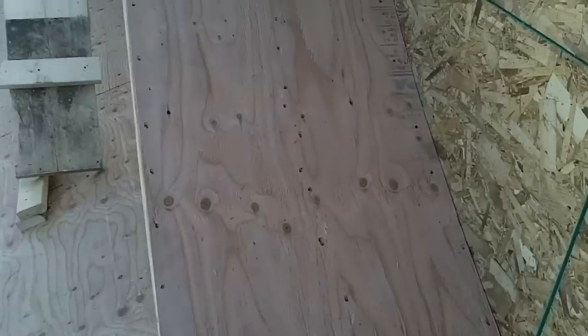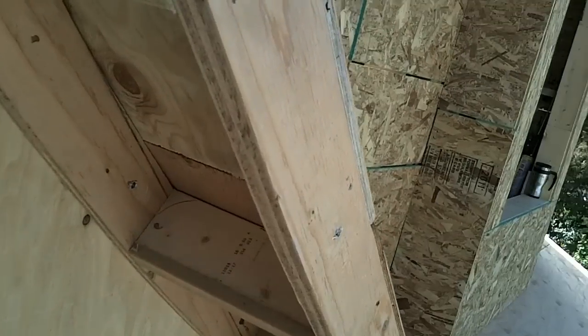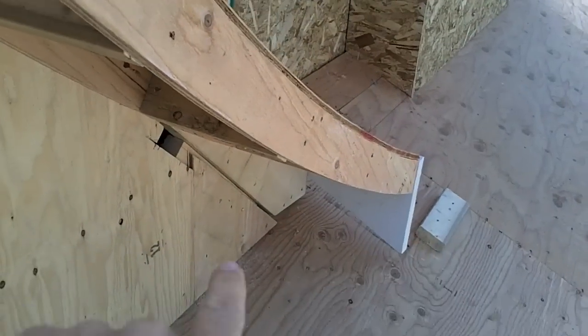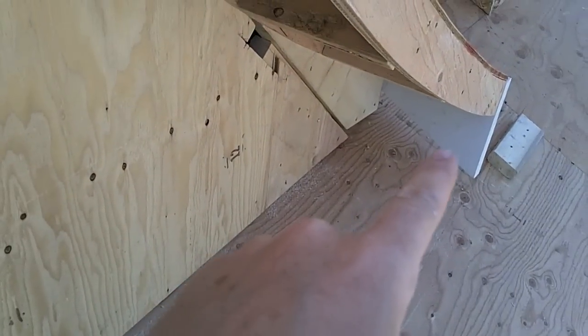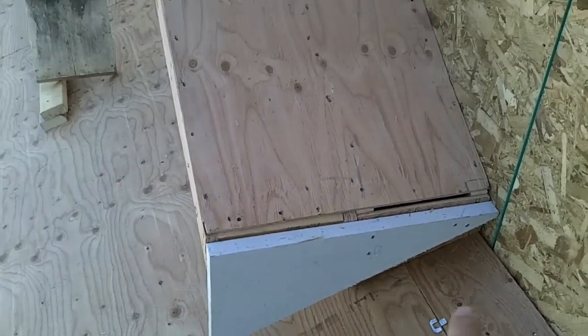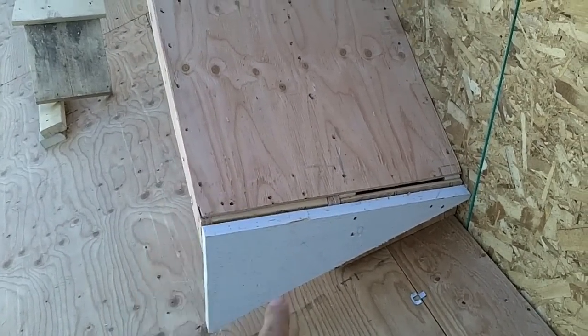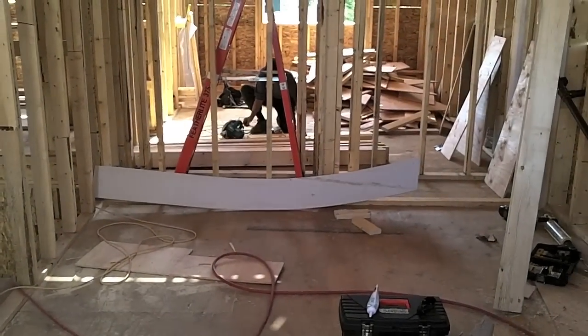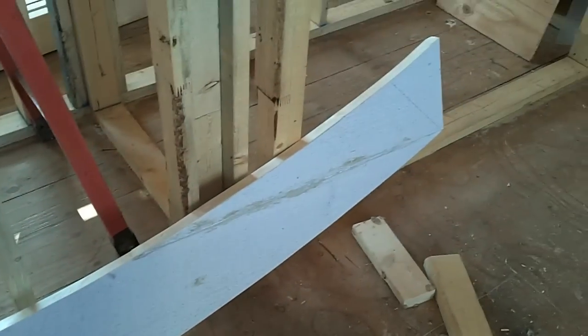This is not the way everyone does it — it's the way we like to do it. We're back on the roof again. You can see underneath here we've got our curved fascia cut and what we've done is we've used two layers of plywood and laminated them together and we've cut that same radius as we've got in our fascia cut. We've rolled the plywood onto that so it actually curves down so that our soffit will curve down and butt up against that end piece — a piece of fascia we've got in here. We can either flash that up or have it come through since it'll be hidden by the fascia in the front anyways, but at least now we've got some solid wood in there. We'll show you how we glued this fascia together to create this curved tail end.